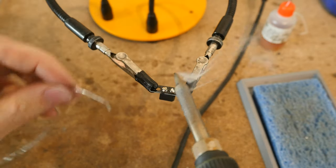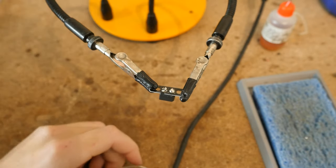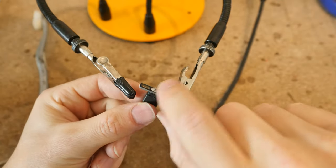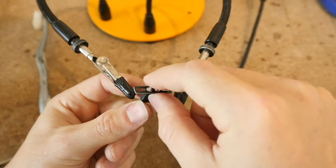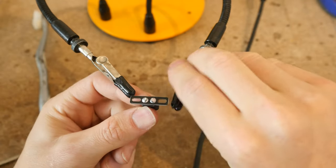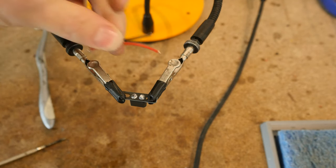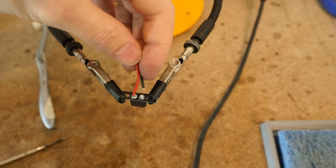That's a little messy but that's okay. I cleaned it up with some isopropyl alcohol and a toothbrush. The positive side — which is the flat portion of the XT-30 — is going to be on the left when facing downward. So the wires point in that direction. I have two 50 millimeter length, 26 gauge wires that are going to attach to this. Just adding a little bit more liquid flux to both the wires and the connector, still at 350°C.